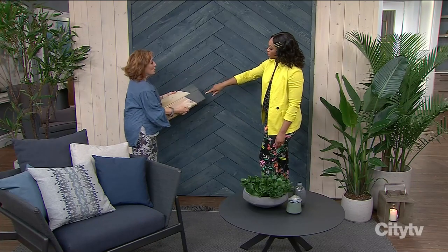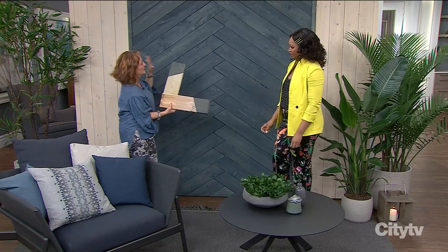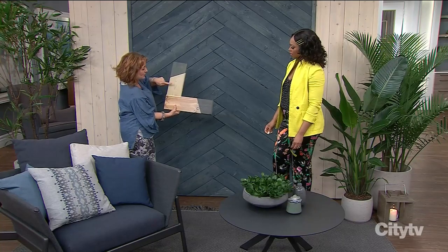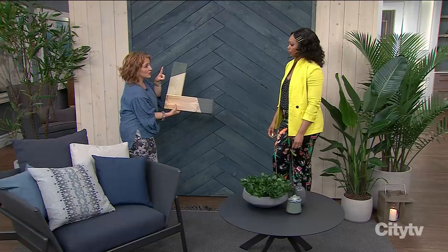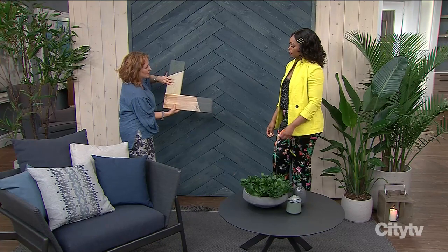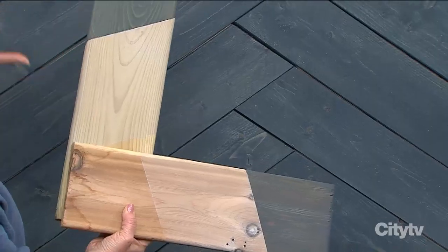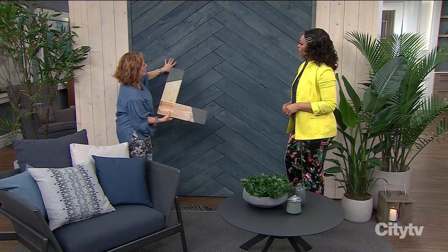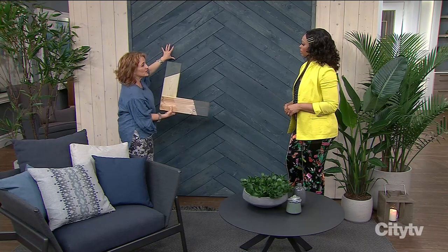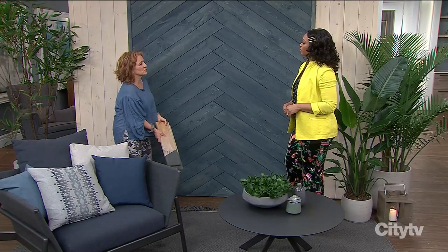Did you prime it? No — good question. When it comes to fencing, you do not need to do a primer if you're using a stain. Whether it's translucent like this silver gray — which is going to show more of the wood color below — you definitely want to test it out first to make sure you've got the color right. No priming, put the stain on. And when it's a fence, you don't need any sort of top coat — this is protective from UV and rain. Translucent in an oil or water base shows a lot more of the wood. Semi-solid shows a little less of the wood grain. And then you can go to a full solid, available in 4,000-plus colors, which hides everything — you go to that when your wood is really showing its age.